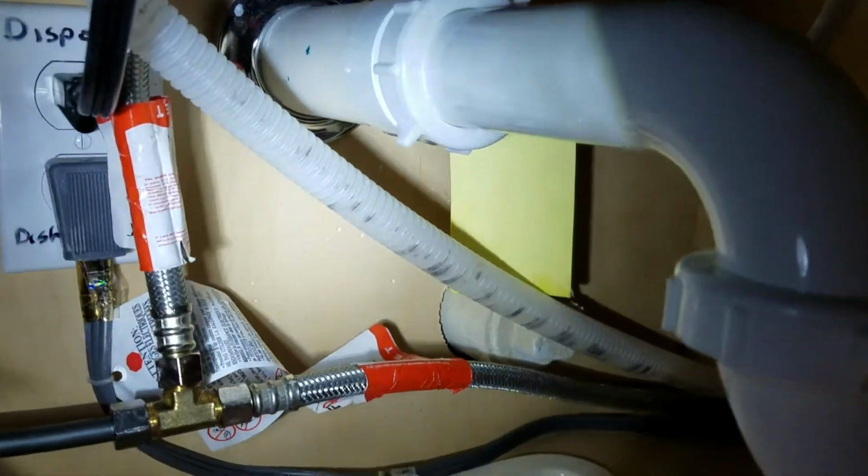So they had an old Schedule 40 P-trap, which is specific to this piping back here. So Schedule 40, and the nut that was down here, it was snapped, and so you had a leak as well as the blockage. So what we did is we just cut it back, glued a new adapter on, and went to tubular. Tubular was existing up here. You can see this pipe that came over, and then also the T, the tailpiece. That was all tubular to begin with.